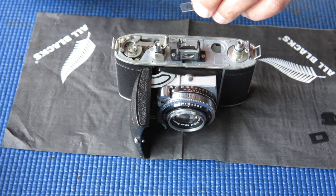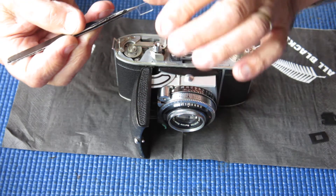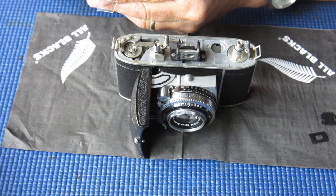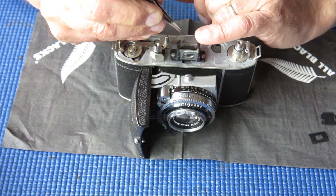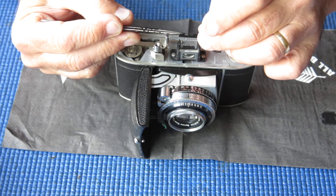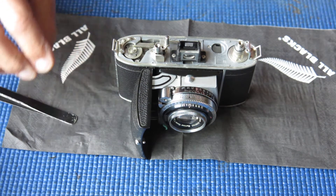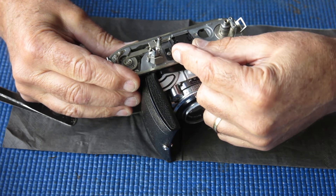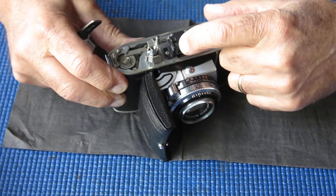At the rear, we have the piece of glass with the rectangular silver mask on it — the silvering side goes to the front of the camera, plain glass to the rear. I'm looking closely to confirm which side the silvering is on and putting the best piece of silver at the top. That drops into the slot, then the curved mask drops in and pushes down to hold it in position. The keeper slides in — I'm lifting the rear part to get it up over the glass — and that clips into place.